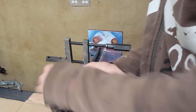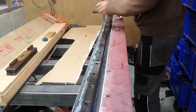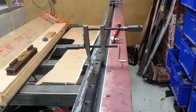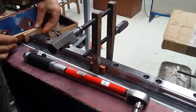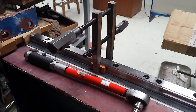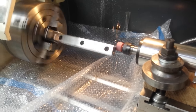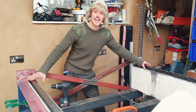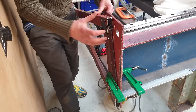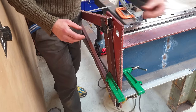After a lot of drilling and tapping through into those little protrusions with the foam you saw earlier — so the drill bits didn't get blunted immediately by the concrete — this is our lap of glory where we're clamping the rail hard against the shoulder and bolting it firmly into place. The other rail opposite doesn't have a reference edge shoulder to clamp to, and instead that's going to rely on the gantry to work as a kind of jig to align it in relation to the rail I'm doing now.